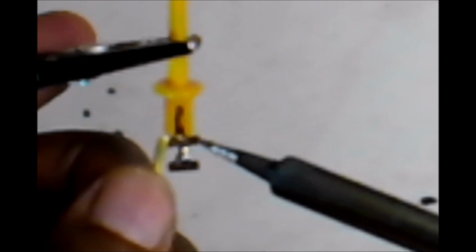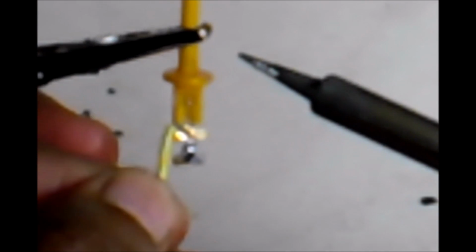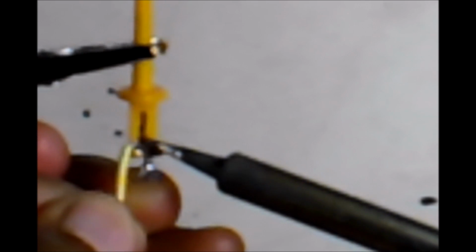And then take it out. Now as you can see, you might have a situation where the top part of the wire is kind of soldered on like that. In that case, because it's pointing out, we want it to be down. It should not have soldered out, but that's the way the strand soaked up the solder in the position that it was. So what we want to do is get a hold of the wire and pull in the direction we want it while we heat up the solder on it, and it'll go in the other direction.